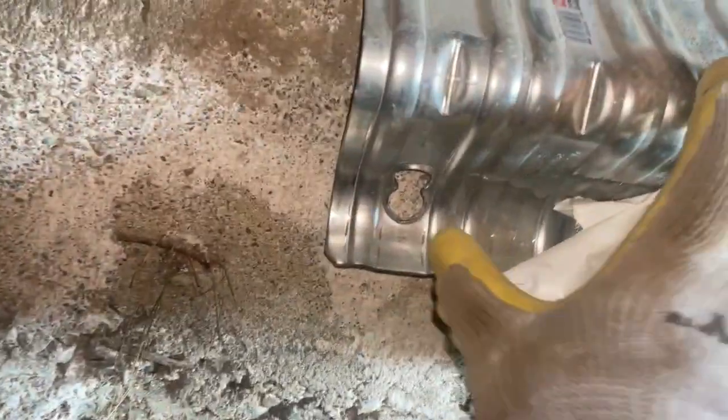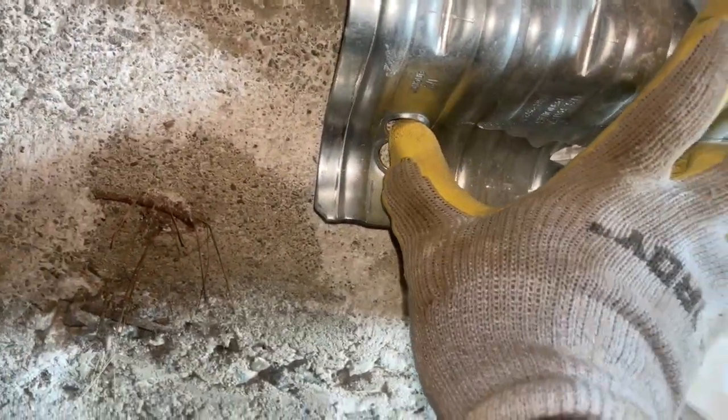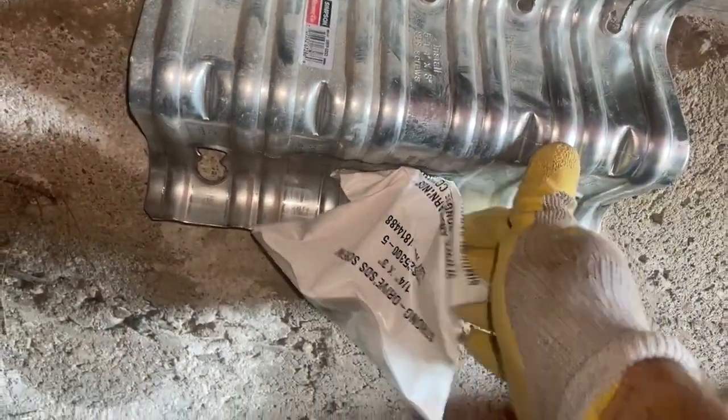Once that's done, I come in with a half-inch bit and drive it four-and-a-quarter inches deep into the concrete, again using the rotohammer. You can leave the plate in place — I'll try to show you how I do this.